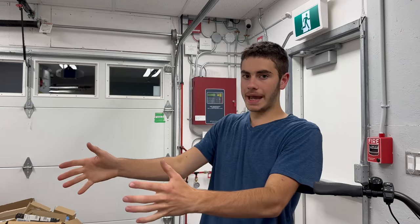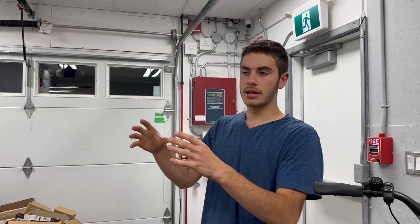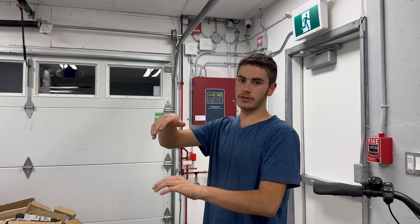And what else do we have to do? We will need to set our isolator boxes and the can of the panel, the actual panel, before we put the guts in it. And once all the mechanical, physical, electrical conductors and cables are in place, that's when we'll start putting in panels, like the actual brains of the panel, putting in the 320, putting in the enunciator, finishing the enunciator, putting up pulls, putting up horns or sounders, smokes, heats, putting in that duct detector.